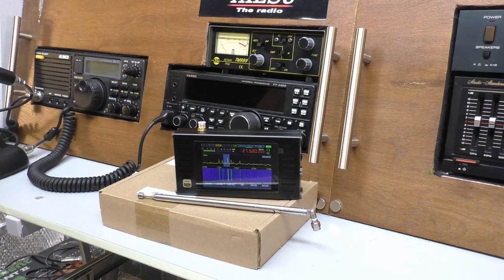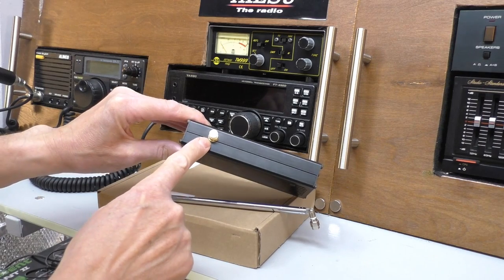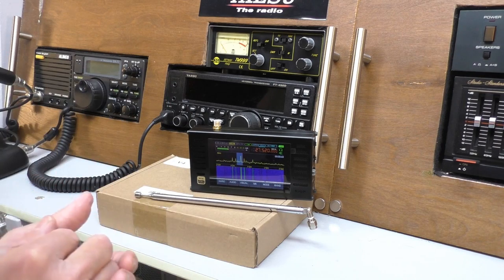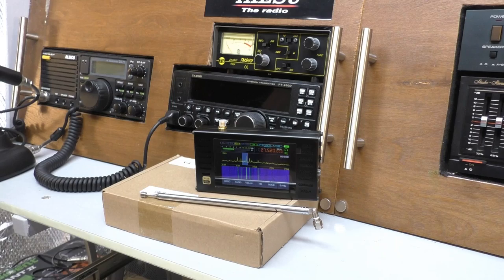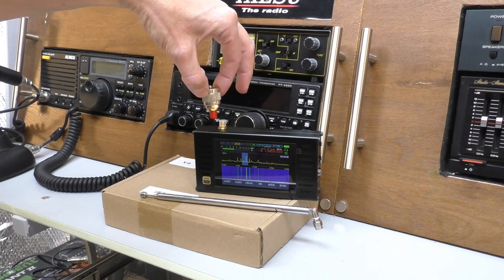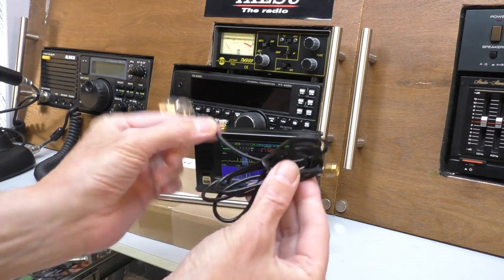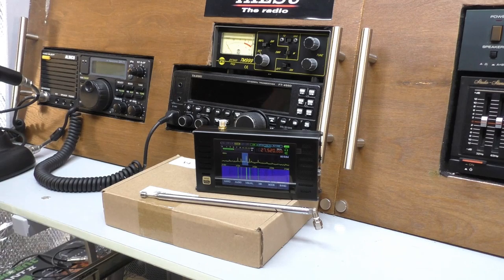You don't get a charger with any shortwave radio. To get the best out of it you're going to need some kind of external antenna. There's an SMA connector on top of the unit, so it's dead easy to connect outside antennas. Even a long wire stretched down your garden will be absolutely fine for shortwave. Available cheap on eBay are little adapters — a PL-259 to SMA connector — that will screw straight in the top. My coax in the shed shack is RG213, which is a little bit stiff, so I made myself a little SMA patch lead going into a PL-259 plug to connect to my external CB antenna.